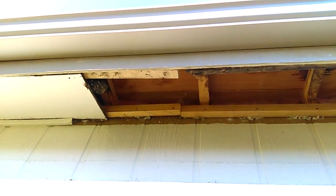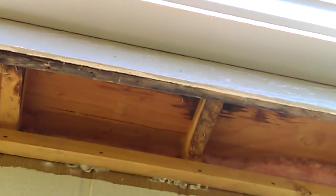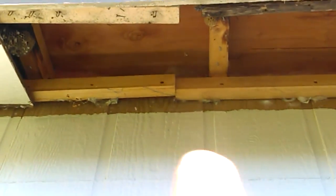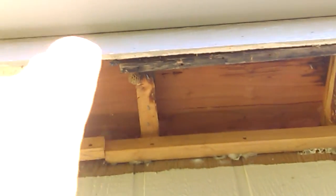It's just a little spot, so a new sheet will take care of it. You can see right here that board is black also, so I'm gonna take all that down and replace it — pull that out of there and clean it out. The boards along the wall of the house I'll nail one side to, and the board right underneath here is what we nail the other side to. I'm just gonna cut a piece to fit.